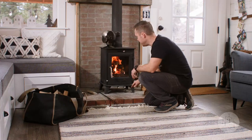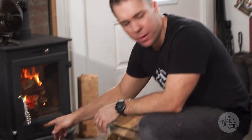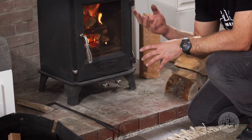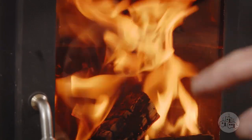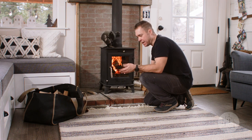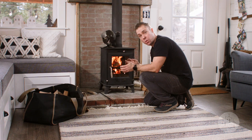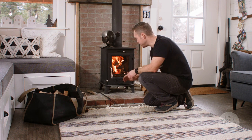When your fire is just starting up, it's best to use primary air. Think about when you're blowing on a fire — you blow on those coals and they ignite. That's what the primary air is doing: there's a little port on the bottom and air is blowing on the bottom of those coals, getting everything going. The secondary air comes in about halfway through the firebox — those are the little secondary air holes in the back. That's for when you have a good hot coal bed and everything is charred. You can shut down the primary, and secondary air is introduced as gases come up — oxygen is introduced and you have a secondary combustion, more of a gasification burn. It's slower, hotter, and a lot more efficient. If you keep your primary air open consistently, you'll burn through a lot more wood, so it's nice to shut that down.